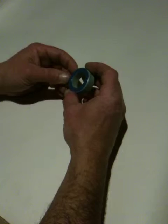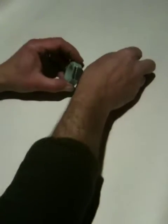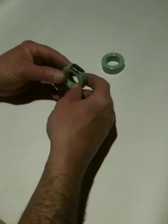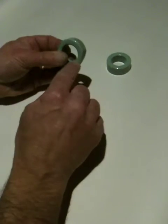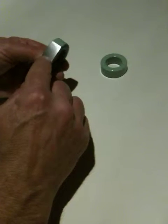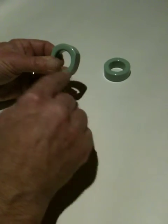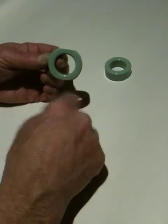So this is a small little micrometal toroid. What I've done is taken one and machined it slightly — a little bit rough, but it's the best I can do. On one side I've wasted it down slightly, so I've ground off this side here. This is going to be the sort of primary winding on here to create a magnetic field within the toroid itself.